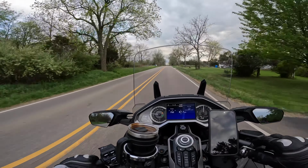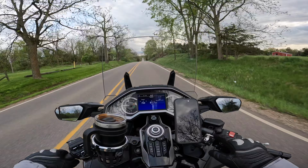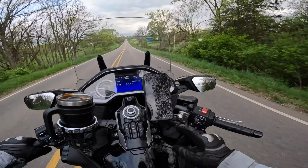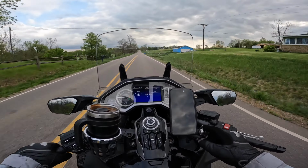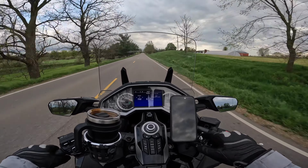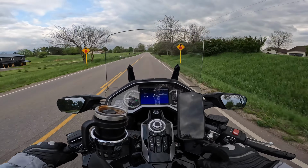And I basically then designed this plate with two stainless steel balls and a stainless steel plate, counterbored the screws, and went through the same thing. You'd need longer screws for it, but you can buy this RAM mount with one sticking off it, so you can still do the same system. And it'd probably be a lot easier too, because for any of those that don't know, the rubber coating on the RAM balls is a required item to make these work properly with the aluminum clamps, these cast aluminum clamps they make. Without it, it's not going to stay.